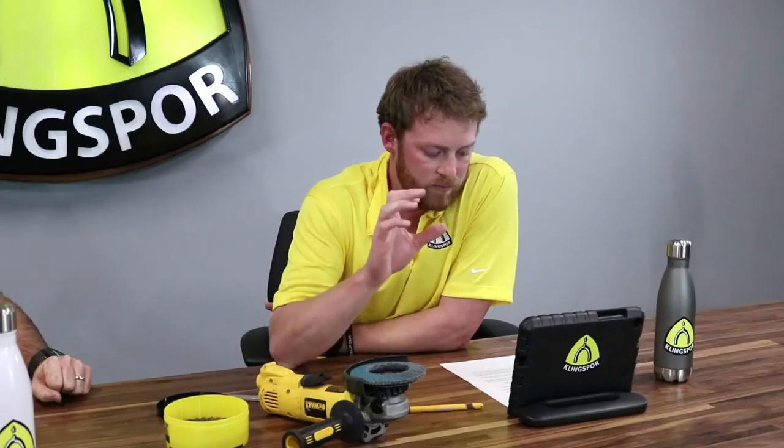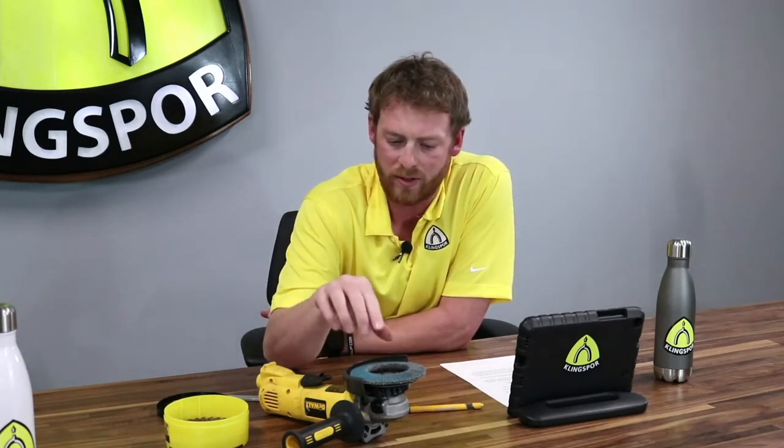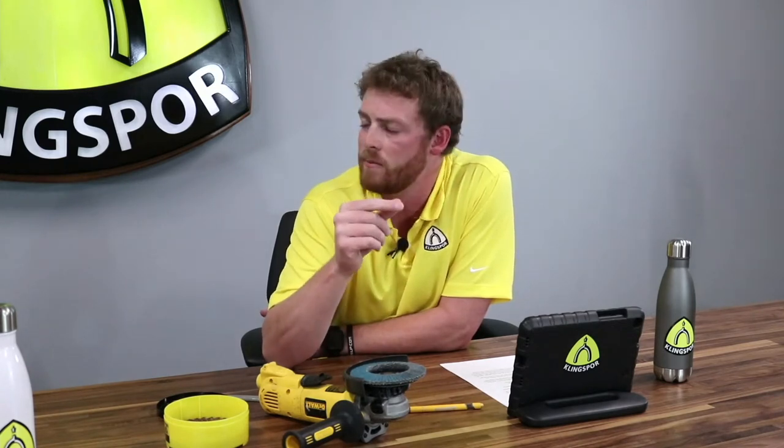So what type of applications are these actually used in? Depending on your shop, we cover all bases whether it's lubricated or just a standard zirconia. The backing plate is a die-cast piece of metal that acts as the interior backing — replacing the plastic or fiberglass backing found on standard flap discs. The first disc I want to talk about is the CMT 726, which is an alumina zirconia grain with a six-degree angle.